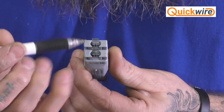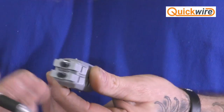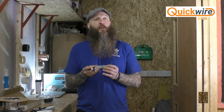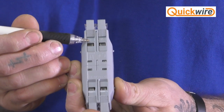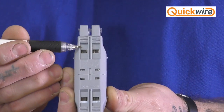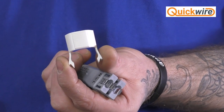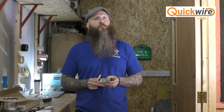On the end you've got the cable entry points — the place where you insert the cable — and that is connected to a movable section which is the clamp; that's the bit that locks the cable in. As you turn it round there is a window, which shows you how much cable is inside the junction box when you come to clamp it, so you know you've got enough and you're making a good positive connection. There is also a cable removal tool, so that if you clamp the cable in and need to remove it, there is a simple and effective method to do that.